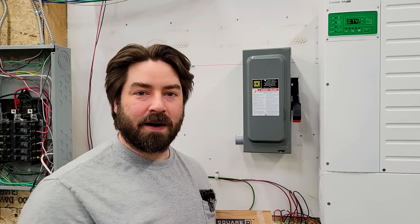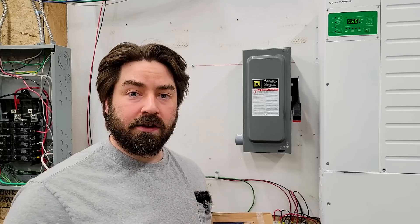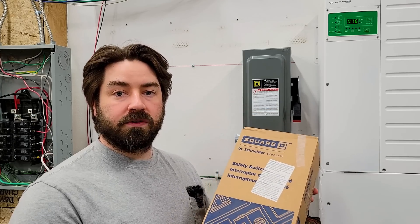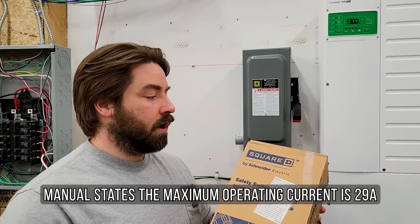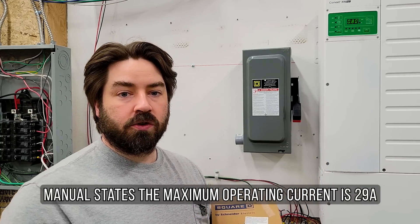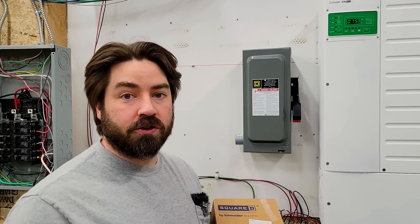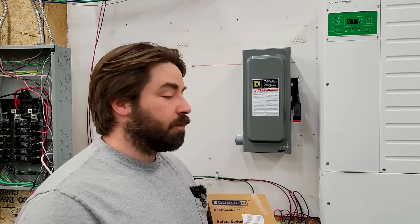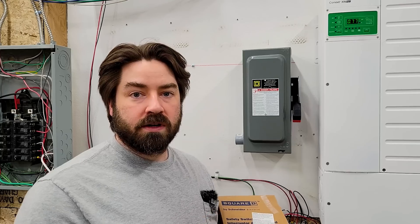Right now I'm installing some disconnect boxes for the PV wiring. I work out here in the garage all the time rearranging things, and I want some additional disconnects inside the garage — I also have some out at the array. This model is 600-volt DC rated and 30 amps, which should be plenty for these charge controllers since they really can't use more than that for input amperage. They're high-voltage charge controllers looking for panels in series to create high voltage but fairly low amperage. I'll be running 18 amps into them with two parallel strings of about 9 amps each.